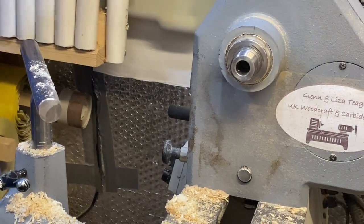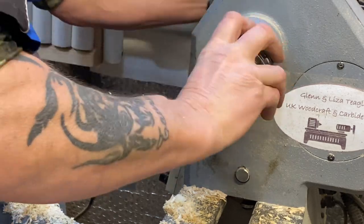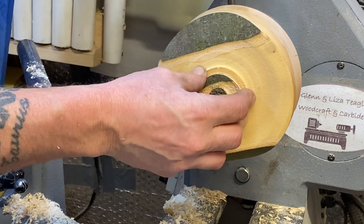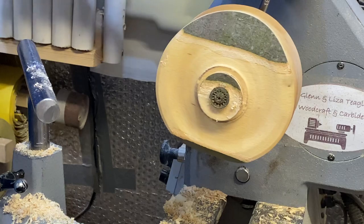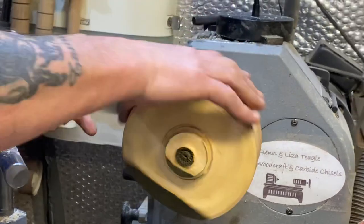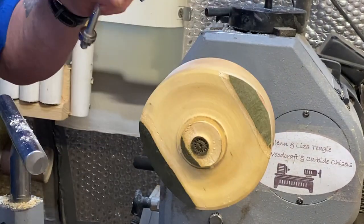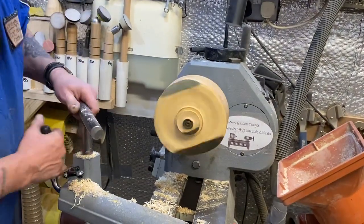Right, pop him back up there, that over there. Just chuck you over. Right, I should be able to get hold of this. Tight, a quarter and a tiny bit because it's wet wood. See, that's why I don't like tenons, because if you crush down on it, especially being wet wood, that can pop off so easy. With that, I'm right inside, grip of jaws, dovetail, it's all good. It's all good.